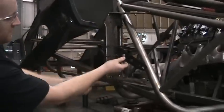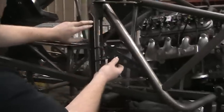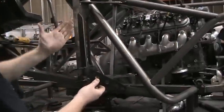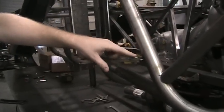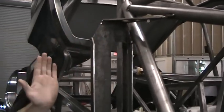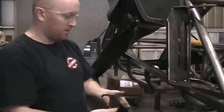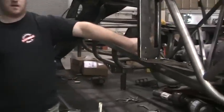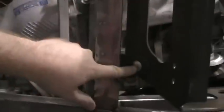So obviously you can see, if I hold it up, the difference in size. This is a 3/16 thick steel plate with a flange here on the edge to prevent it from flexing. You've got the gusset on the bottom here that bolts to the chassis. Again, we use the carriage bolt to make it easier to bolt up. And then the same thing on the top here, another flange that gussets its forward motion so that it doesn't want to flex forward and it can't pull in and out, again, due to the weight of the door. You can also see that we've got it bolted here to the chassis with these couple of tabs here and here, and then the hinge mount plate would mount here.